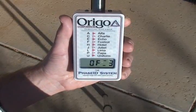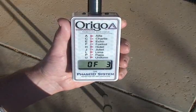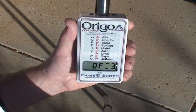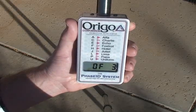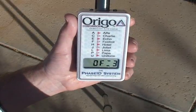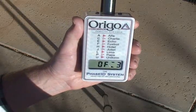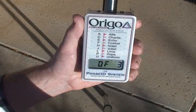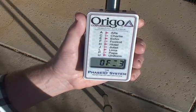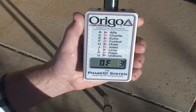And that doesn't mean it's locked to those satellites. It just means that they're theoretically available if you had a 180-degree view of the sky, or a 360-degree view of the sky. But in many cases, buildings and so on will shield some of the directions, so when it finally locks, which it shows now, it only has 3 that it actually locked to. I mean, not a very complete sky location, so that means a lot of satellites may be either not present, since GPS satellites are always moving, or perhaps are shielded by buildings or other things.